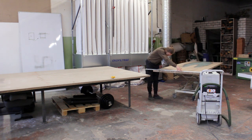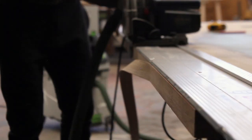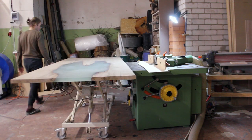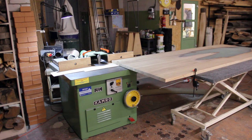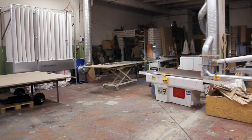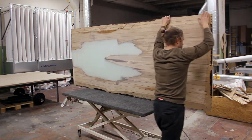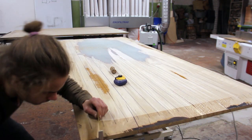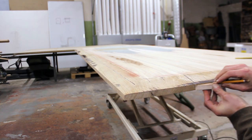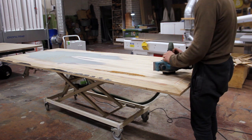At this point it was safe to cut all the edges and make the corners square and true. I also decided to make shallow bevel cuts from underneath to make the tabletop look even lighter. But I did the procedure a bit wrong because the blade on the shaper was getting pinched by the offcuts, leaving a lot of burns. It was an easy fix though — I just took my battery planer, hooked it to the vacuum and planed off the rest of the material.